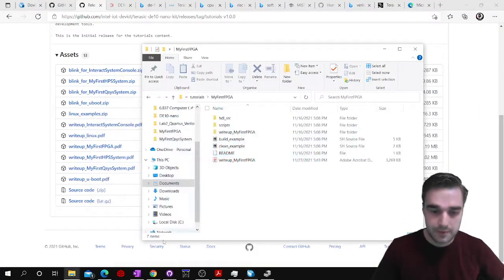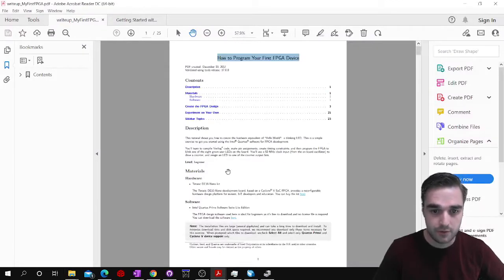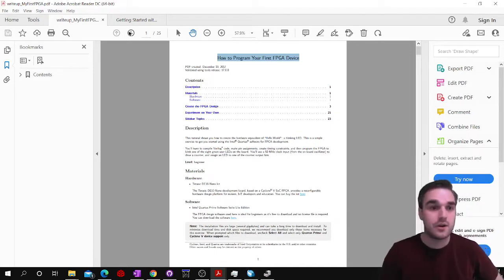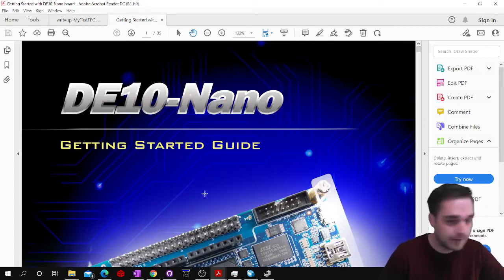Now, before we can actually start digging into this very nice tutorial, and if you want to spend more time with this tutorial on your own time, feel free. I'm just going to skim through and get it done fast and bring up important points worth talking about. Before we get started, the other thing we need to do is install the USB Blaster. If you haven't done this yet, this is required. This is what's going to allow you to connect your DE10 Nano to your PC and program it.